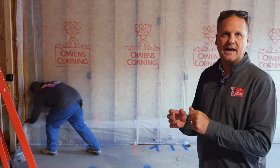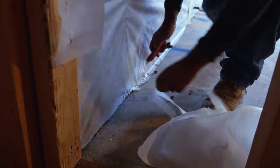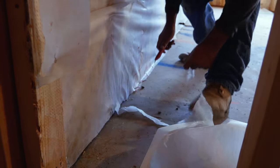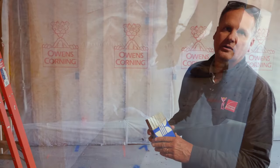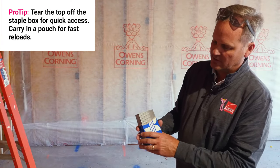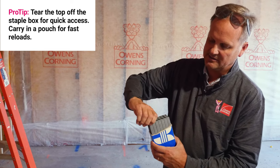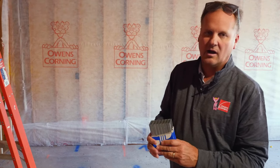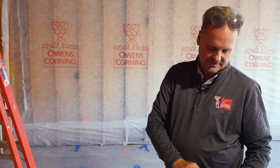Rocky uses the last cavity to stretch the material, so he's not trying to stretch and hammer tack right next to his hand. It's a lot easier to get tight fabric that way. Installers who want to be quick will tear the top off the staple box for easy access, and our guys also use pouches to hold staples where they're still easy to reach.